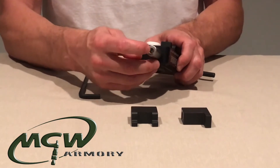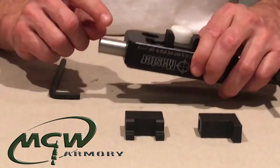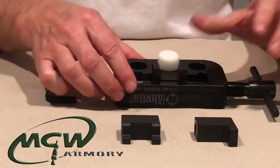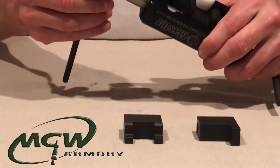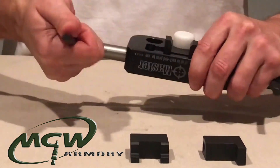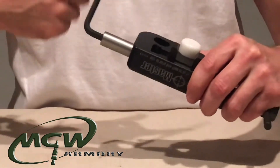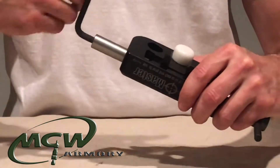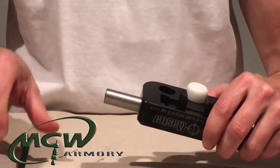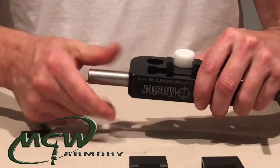You'll see that we have a stainless shaft that has a hex broach on the end of it, and that holds the block into place. It is left-hand threaded into the main T-handle side, so you need to make sure the provided quarter-inch Allen wrench fits into the slot. You want to turn it clockwise — do not try to turn it conventionally and snap it or strip out the threads thinking that it's just too tight. You have to turn it clockwise because it's a left-hand thread.